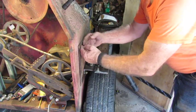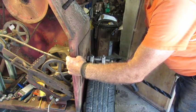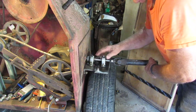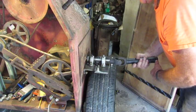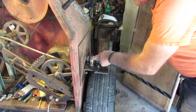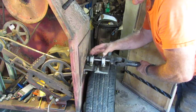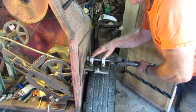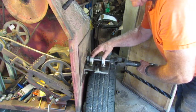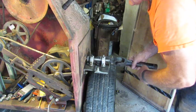Now, this is the outward piece of steel that I've sandwiched — this thinner material right here, which is still 16 gauge, pretty thick material, might be 14 gauge. But the weak thing that I have are these pillow block bearings. These are very light duty blower bearings, but there really is not much of a load on them, especially if I've got the alignment correct. There's still a light duty bushing — a bronze bushing — instead of an actual ball bearing or roller bearing. I've got my eyes peeled for a set of pillow blocks; there's a five-eighths. Whenever I come up with a set of cast steel pillow block bearings with replaceable inserts, I'll go ahead and change these guys out to those much heavier duty ones.